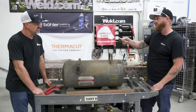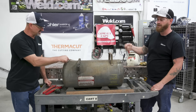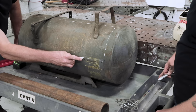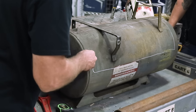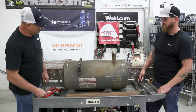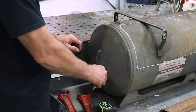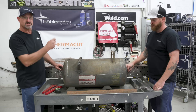We're going to use a cutting wheel and then the torch to make the radius cut work. You can see this is just the baseline where the door is going to be — we'll take our wire wheel and clean it up real good, then get started radiusing the corners nice. That'll be our door. We'll cut these brackets off, clean everything up real nice, and then our exhaust pipe — our smoke pipe — will go right almost in the center.